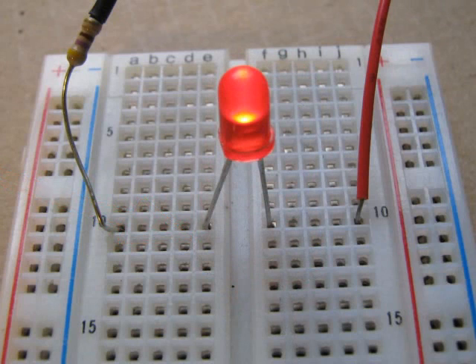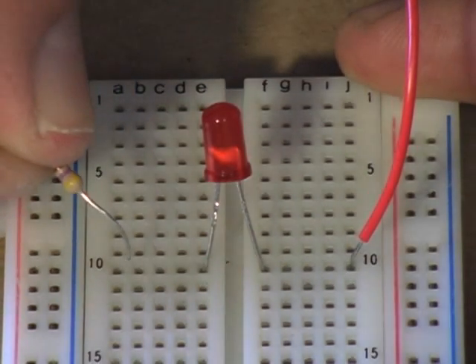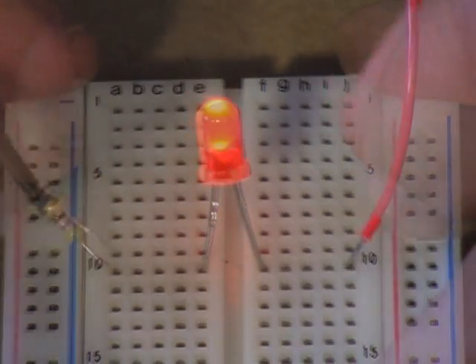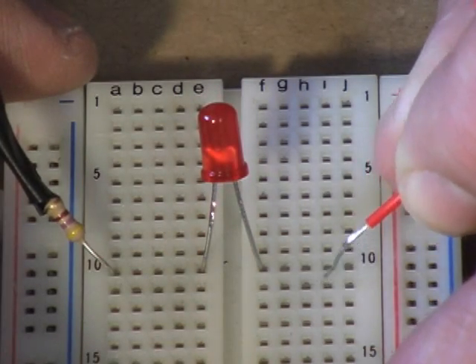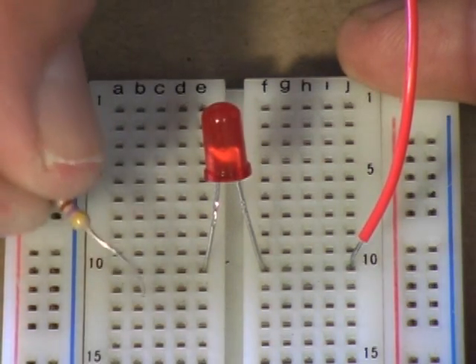Here is how these boards facilitate circuit building. The negative black lead is connected to the LED by a metal conductor under the holes from 10A to 10E. Similarly, on the other side, the LED is connected to the red positive lead by a metal conductor under the holes 10F to 10J. This means you can plug the black lead into any of the holes 10A, B, C, or D — the metal bar ends at 10E. This is true for the positive side of the board also. But if you connect to a different row, row 11 for example, the LED won't light. Each row is separated by an insulating plastic barrier.